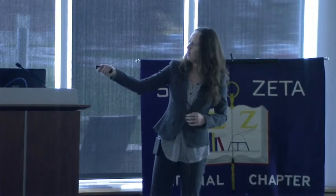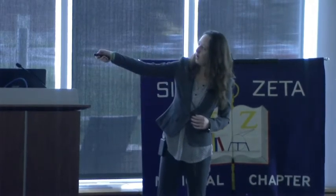This is an IV and power curve I was able to get with the new instrument, using a prefabricated silicon solar cell for which we knew all the measurements, so we could determine whether or not the instrument works as expected — luckily it does. You can see on the y-axis where the graph crosses is the short-circuit current, just over 10 milliamps. On the x-axis is the open-circuit voltage reading just over half a volt, and the red line is the maximum power curve. This figure was taken from my honors thesis that I just submitted.